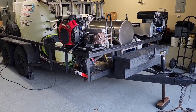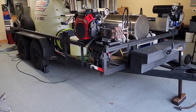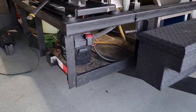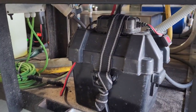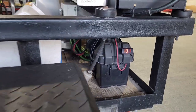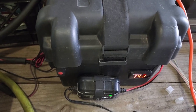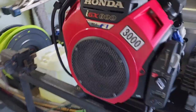Right now I currently have all the batteries plugged in because we're having a winter freeze snap down here in Texas. I keep a digital gauge on there with a NOCO Genius 5-amp charger on each battery so I can see the battery state of charge. I've got both batteries for each machine, plus my 12-volt system battery, and you can see all the batteries are fully charged because I've had them on the charger for a couple of days.